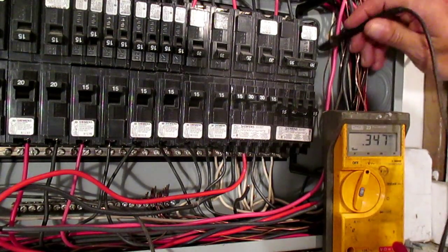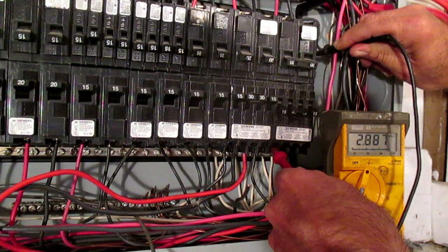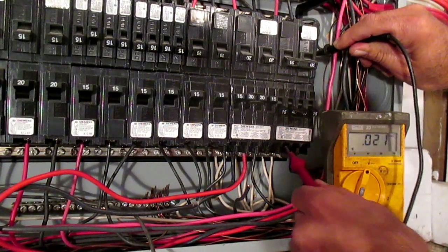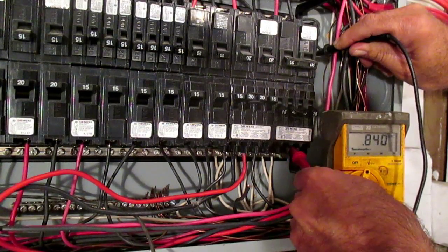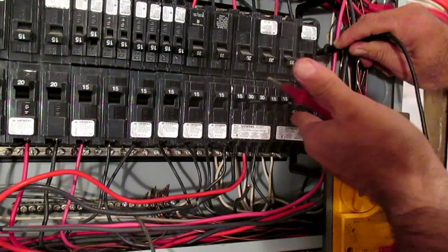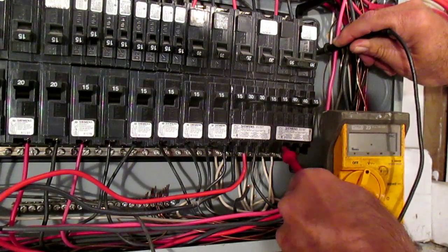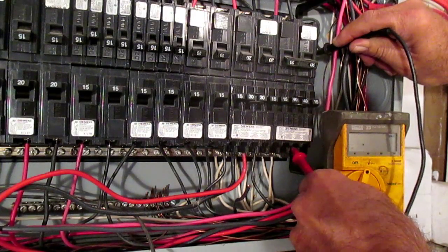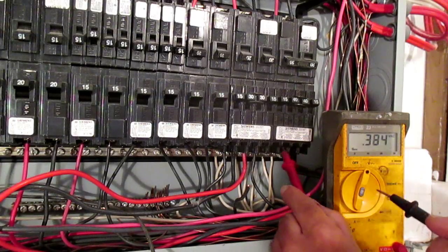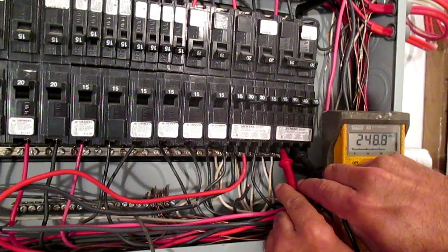Now I'm going to turn the main breaker to the house on again. With the main breaker turned on, I'm going to go on our bus neutral bar there. You can see over on our meter it says 2.8 volts — that's basically nothing. With the meter lead off we still get something there, 1.4 volts, so they're all basically dead, and that's because we haven't actually turned them on. We flip these all up and there we go — we get a reading of 120 volts, 120 volts, 120 and 120. And for a range, if I go between these two breakers here, we should see our 240 — and there's the 240 we need for the stove.